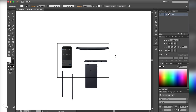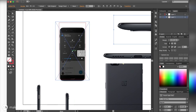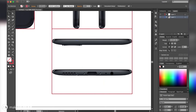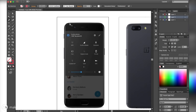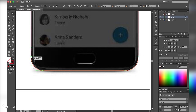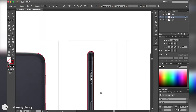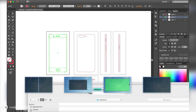I'll save those images and bring them into Adobe Illustrator, where I'll create a rectangle matching the dimensions of my phone measured with my digital caliper, then size the images to match that rectangle to make sure they're perfectly to scale. I'll do that for all six views, and then I'll use the pen tool to trace the outline of the phone and adjust things to match as closely as possible. I'll also trace out main features like the cameras and anything relevant for designing the case.